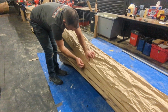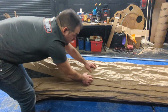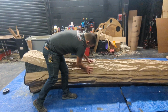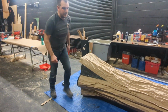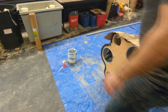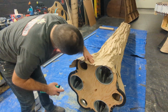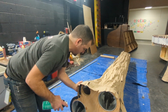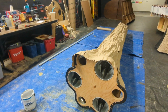This here and that. And I'll be here with the staples and stuff too. Oops. Just going to be aware of that. Be careful not to get it to rip. The other thing I'm doing is down here at the end, when I'm satisfied, making sure it's nice and stuck, I'm going to get my glue and come around to the bottom of the end, making sure that this is sitting tightly down to that vertical edge of the plywood surface that we have been trying to preserve through all of the different steps, because that's where everything's going to attach.